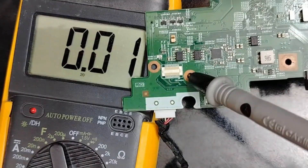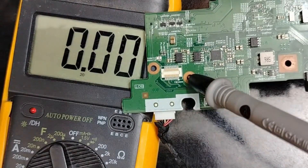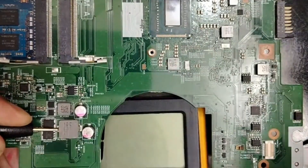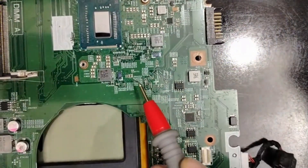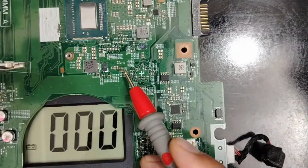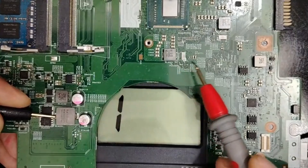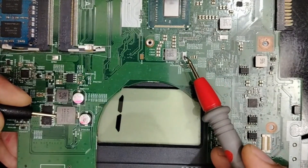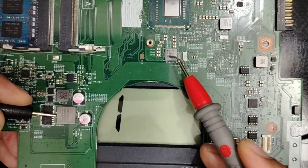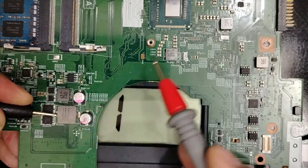If you understand this process, you can repair and you can follow any voltage within any motherboard. Pay attention guys — one probe here, one probe on this side, and I will go to this channel and look. Direct connection means 5 volt travels directly to these capacitors in order to be applied to this driver.